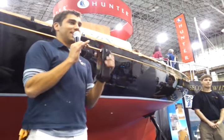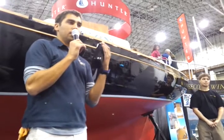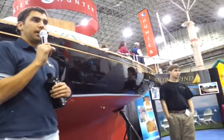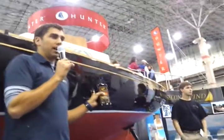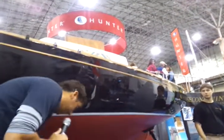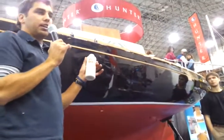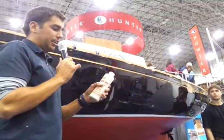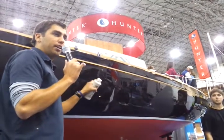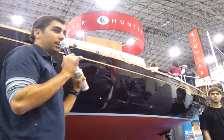If you bought a boat, you've got to keep it clean. You've got to keep up on it. I don't have a gel coat sealer longer lasting than what I'd recommend with typical wax. This is the Meguiar's flagship wax. Some other waxes, a lot of people, especially down in Florida, we find like the Collinite stuff. It comes in a bottle like this. This is actually the leather cleaner, but Collinite insulator wax. Again, that's just a wax, so you want to have a good surface to start with, and you're going to form up a barrier on that. It's not going to do anything for taking off the particulate or taking off any oxidation.